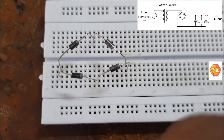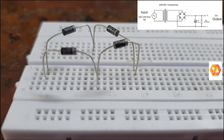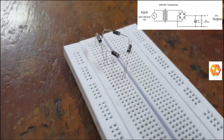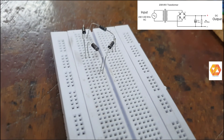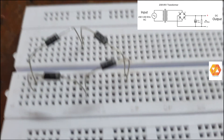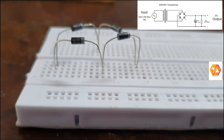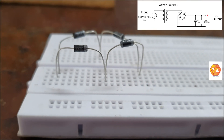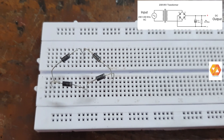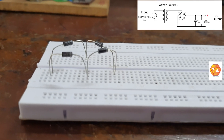D1, D2, D3, and D4 are the four diodes. Connect all four diodes as per the circuit diagram, otherwise the output will be distorted. Once the bridge connection is completed, connect the load resistor. Here we are using a 1 kilo ohm resistor as the load, and then connect a step-down transformer. Here a 230 to 6 volt step-down transformer is used to supply the input AC — 230 and 6 are both RMS values.